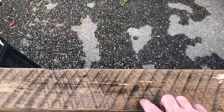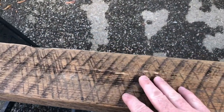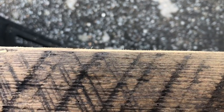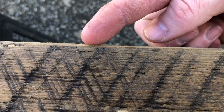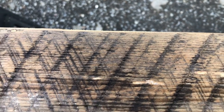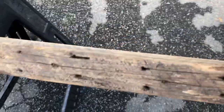I've got all the sides sanded, but remember where it was wet — you can still see it looks kind of dark and damp there. When you sand it if it's wet, you can see the little strands sticking up because it's wet. I want to let this dry out, possibly till tomorrow, and then I'll re-sand this area — that should take care of most of that.